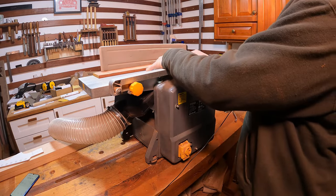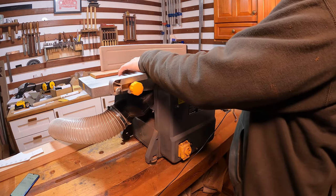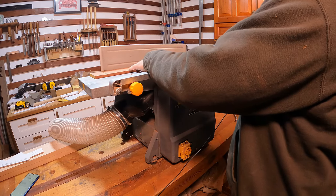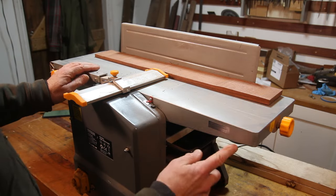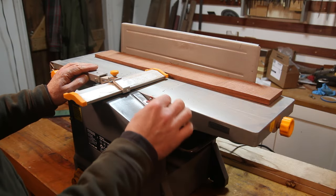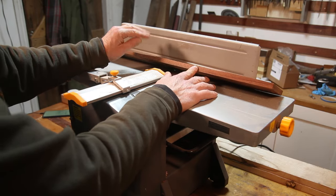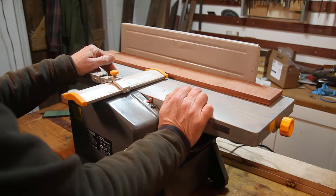Okay, so I've got this set up in planer mode first, because there is ever so slight unevenness on one side of this. So I'll flatten this off on the planer, and then I can set it up in thicknesser mode. I'll get the two neck blanks thicknessed down first, and then I'll get this stuck to a stout piece of timber just to keep it straight, and we can send that through and get that thicknessed as well.